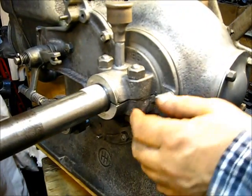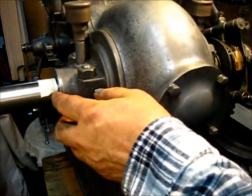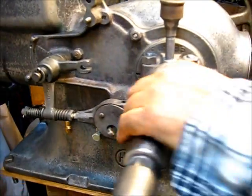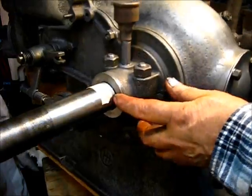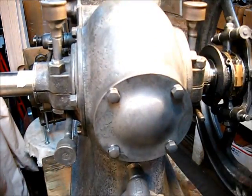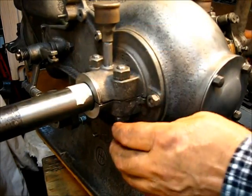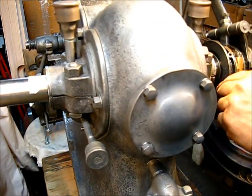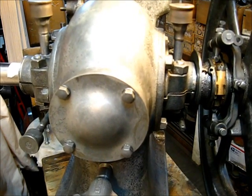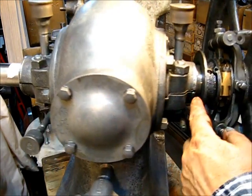Okay, I need to go back half of that. I'm going to turn that other side so that — okay, that's about half of that measurement. If you're not comfortable doing this by eyesight, then get a ruler on it, get a dial indicator and set it up there — magnet it over there. If you're not comfortable doing it this way, then do it with the dial indicator. This works really good and you've got several thousandths of play there.